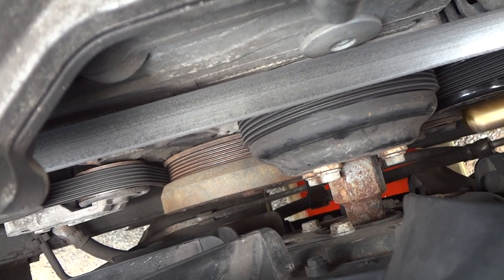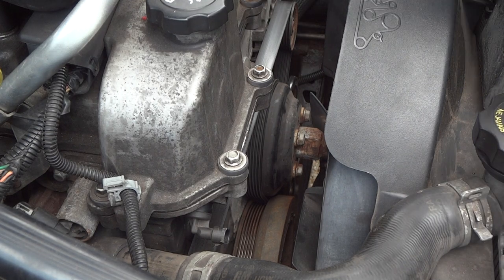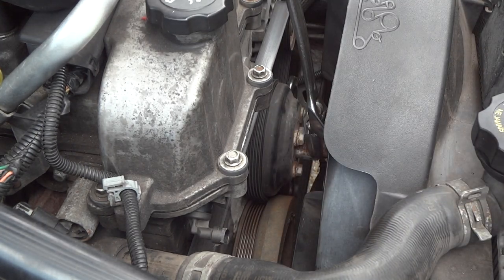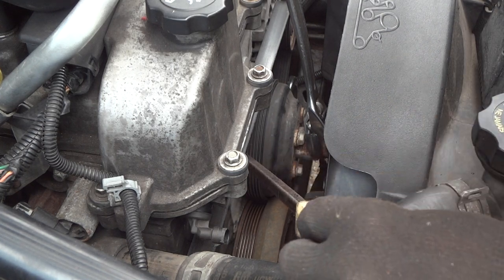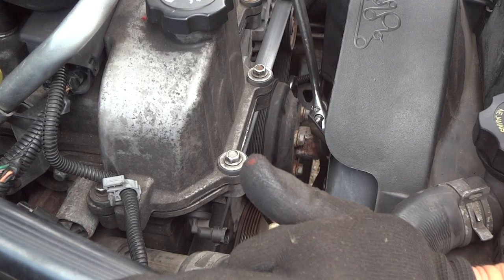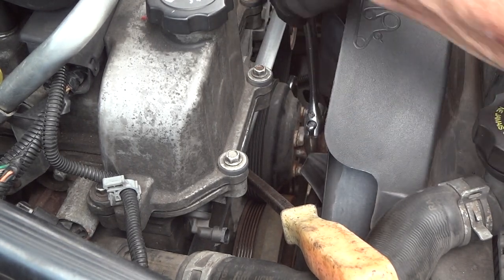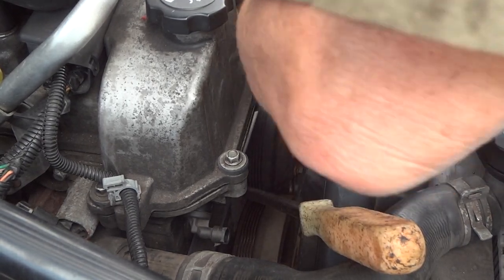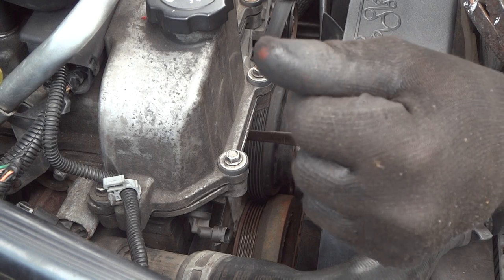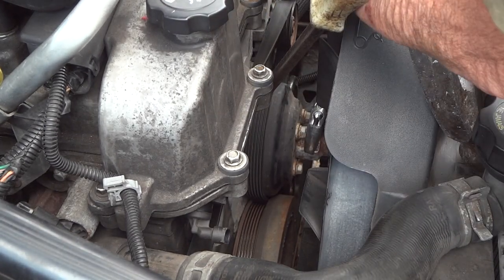Just short little bursts of heat, nothing crazy — just do this for a few minutes all the way around and we'll try to break it loose. It's pretty warm, cooled off a little bit. I'll leave the belt on here because that'll give us a little more leverage, keep things from turning. I'll put pressure on that right there and it may take several tries — I may have to use both hands on that.